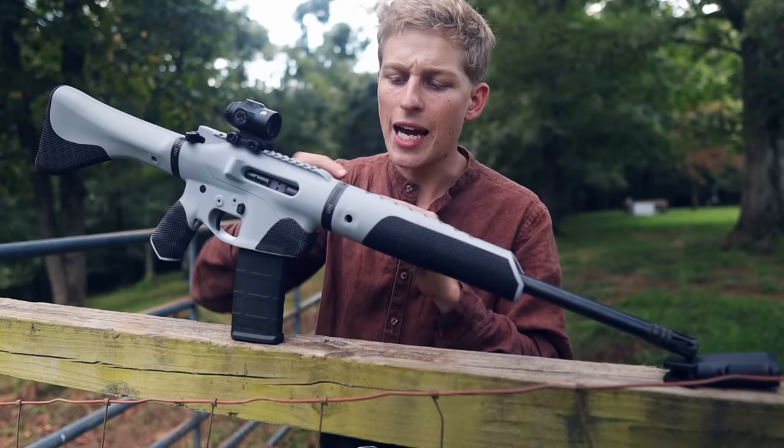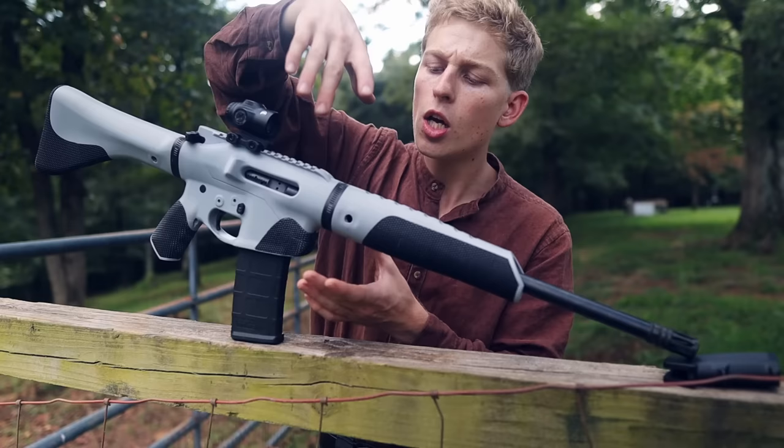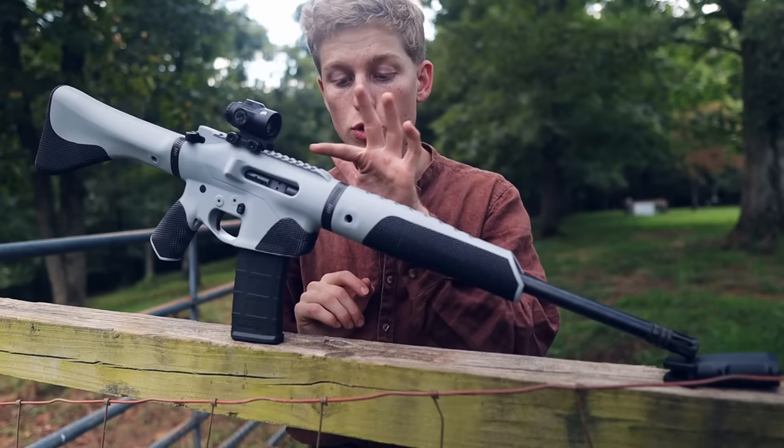There's actually just the special profile on the upper receiver, the handguard, and of course the lower receiver and the stock. And then these clips, which are printed from a polycarbonate, are pulled into those little dovetail profiles using the hose clamp. And that is actually really, really strong, and it's super streamlined except for the worm drive mechanism on the hose clamp.